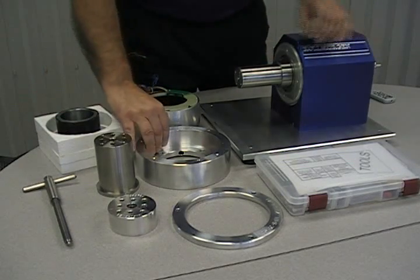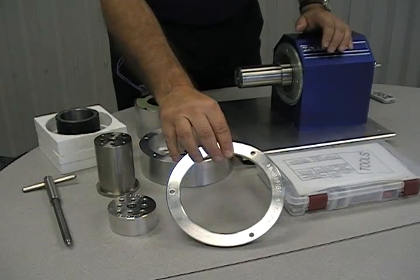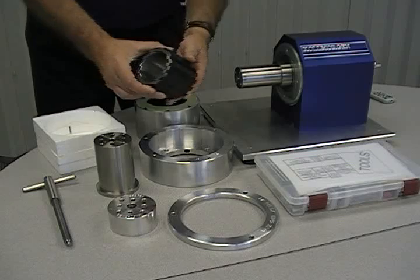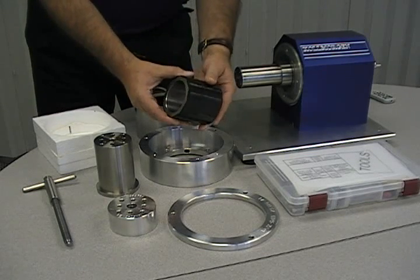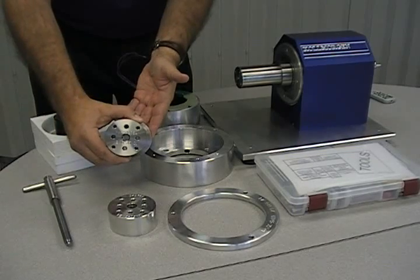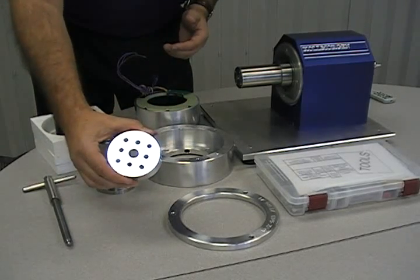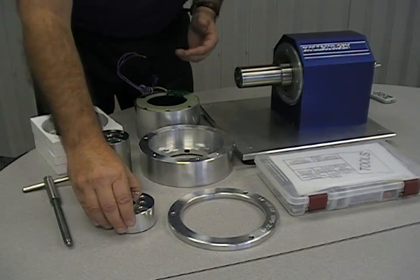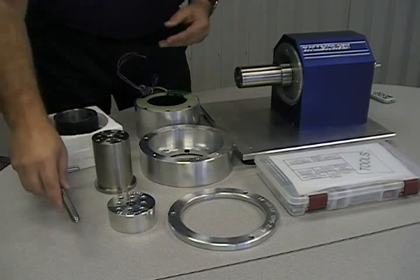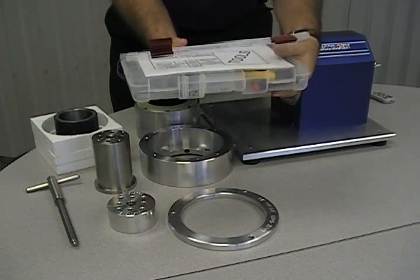Please keep in mind that the magnets are fully charged. The stator adapter and stator clamp will hold the stator in place on the demo unit. Since the rotor is larger than the shaft on the demo unit, an adapter will be used. The adapter consists of the adapter and the clamp ring. The jack screw is supplied and provides a slow, controlled method of sliding the rotor into place. Without it, the rotor would slide into position at an uncontrolled speed. It is also used to remove the rotor from the shaft by providing a mechanical advantage against the permanent magnet attractive forces.